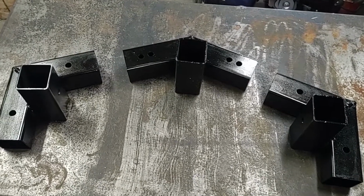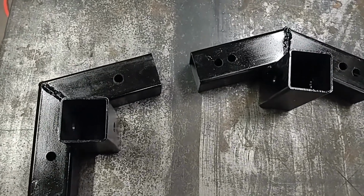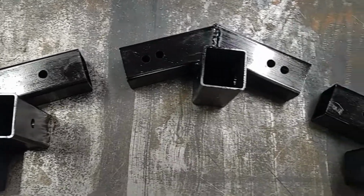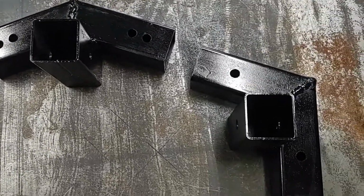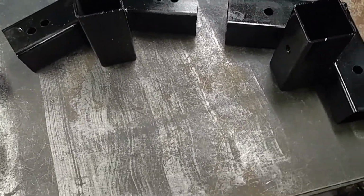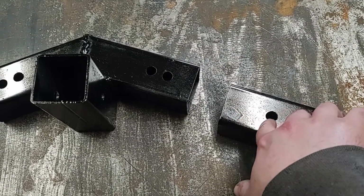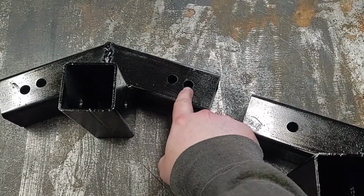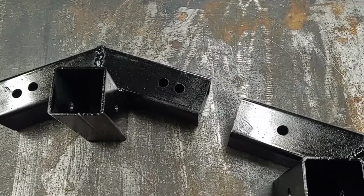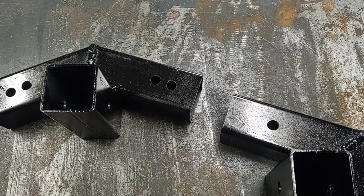Okay, so I finally finished all of my fittings and painted them. I did make one change here. Instead of 30 degrees, I went down to 20 degrees for the roof. This fit my tarp a little bit better, since I'm trying to match an existing setup. Also, one thing to watch for is make sure you account for your overlap. Here I had to make a change to the bolt distance to the edge, since I didn't measure that correctly.